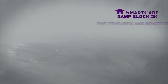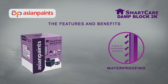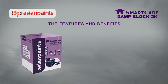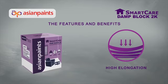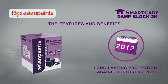The features and benefits of SmartCare Damp Block 2K are as follows. Damp Block 2K can resist up to 5 bars of hydrostatic pressure. It forms a highly elastic film that provides elongation up to 100%. It provides durable and long-lasting protection against efflorescence.